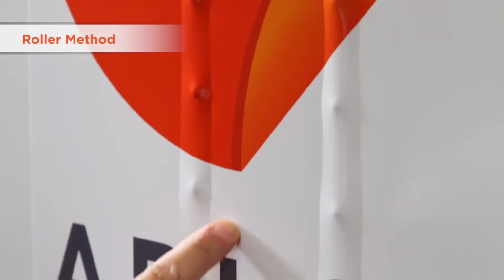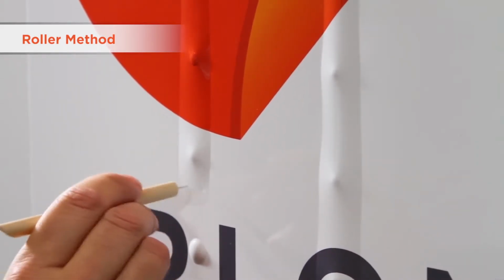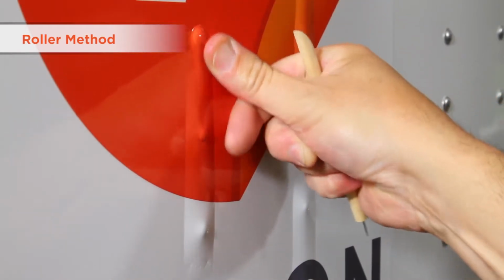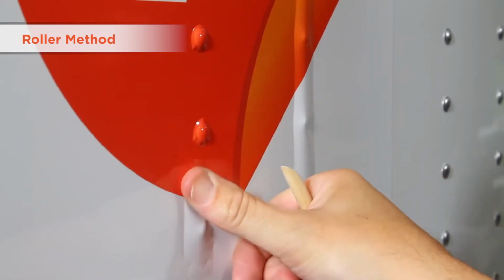If the vent collapses by accident, you will need to poke a hole in the vinyl to release the air, but don't make the hole near a rivet. Work the vinyl down around the rivet cold. Then, finally set them with heat. This will help keep the vinyl sealed around the rivets.